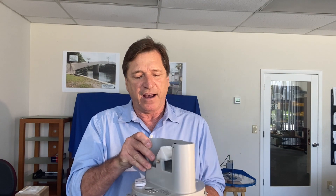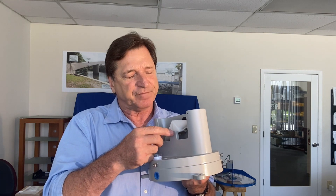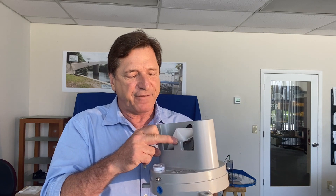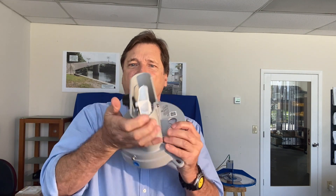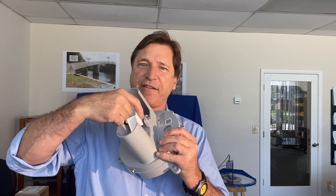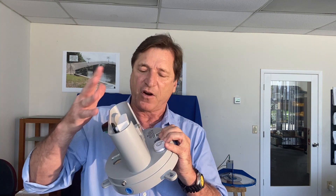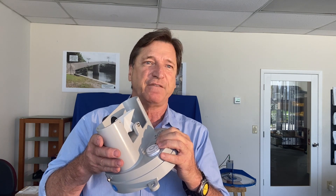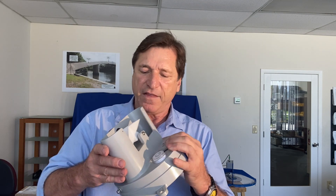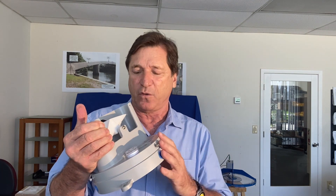The next thing is the pivots that this bucket tips on. These are a compressed sapphire material that sits inside the rain gauge on either side, and the pivots sit inside the sapphire bearings. There is a slight amount of play, but this sapphire material is so hard that it will basically never wear out. The sapphire pivots also give the gauge incredibly stable calibration over the long term. We have customers that check these after many years and find that if you clean them, they're still in calibration. This dual compressed sapphire material is across all our gauges, including the TB4 and TB7.